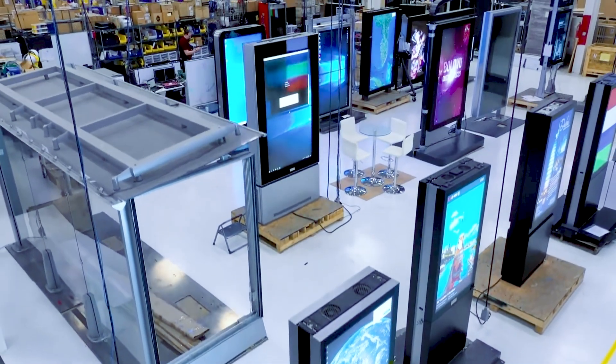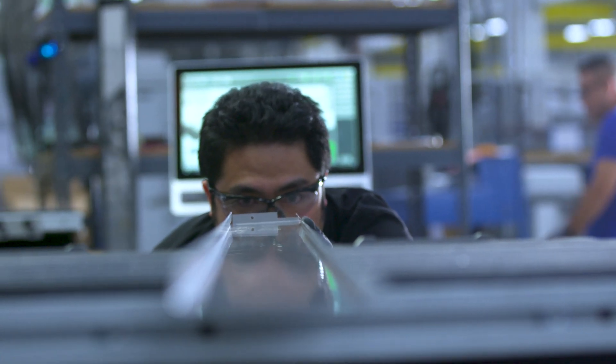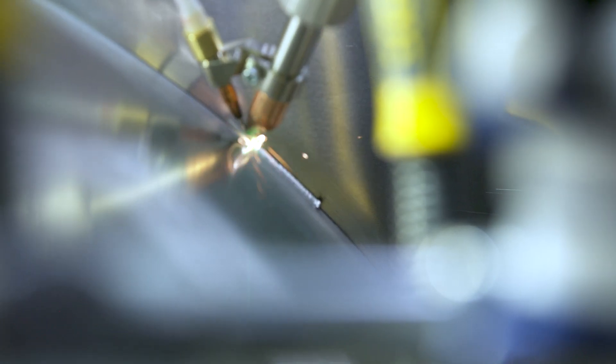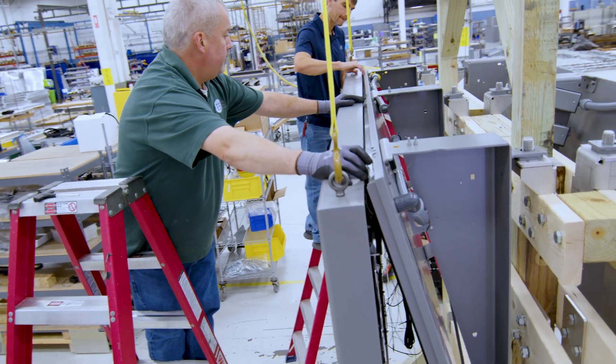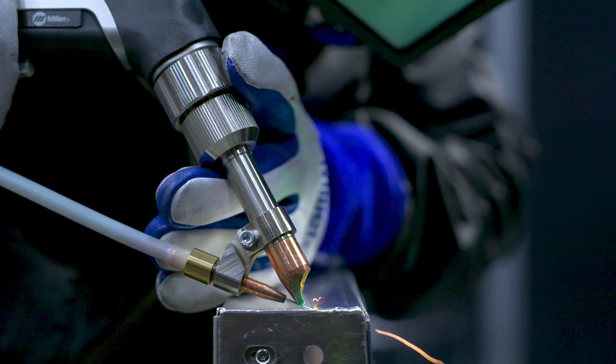The LCDs are very sensitive to torsional distortion — twist, bend, and bow — so we're trying our best to keep everything laser straight and ruler flat. With the laser welding we're getting better results than ever, without the distortion. Parts fit, so we're no longer struggling with welded assemblies that are bowed and twisted. With the laser we've had very, very little problems at all.